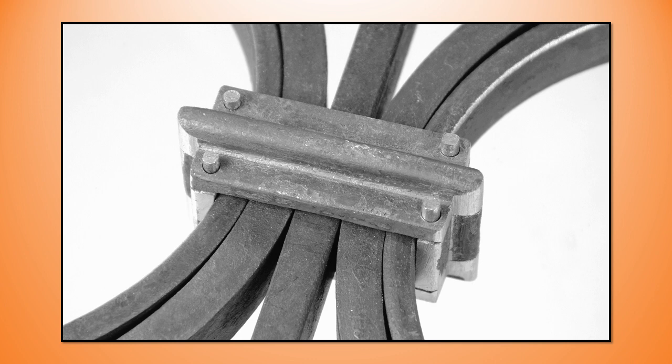You'll notice from this photograph that the joints of this style of collar are placed on the side pieces, keeping the viewing surfaces at the front and the back clean. The front and the back material therefore has to be cut overly long to accommodate for the extra material that you're going to need in here.